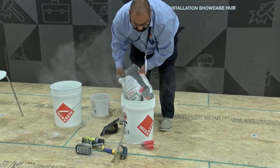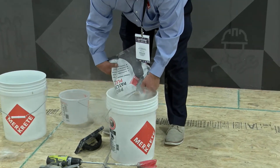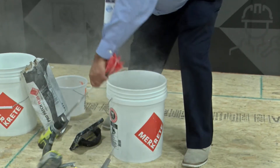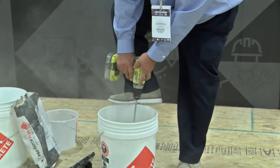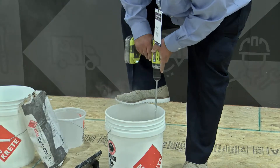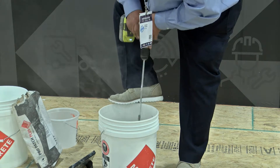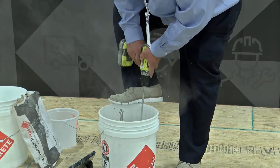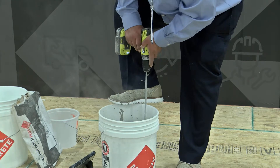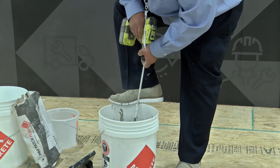When I was in Texas working with some installers, they were taking these products, mixing them up very fluid — very wet, or what I refer to as loose — pouring them out on the floor and taking a screed, a long straight edge, dragging it across that concrete slab to fill in the low spots and create a flat floor. When you're installing tile, the bigger the tile, the flatter that floor needs to be. We don't use thinsets or mortars to level floors — they will shrink. These other products are made not to shrink. What's unique about this product is in 45 minutes you're walking on top of it.